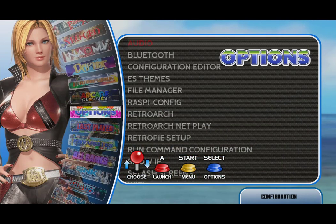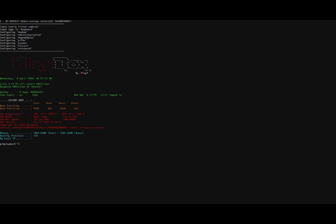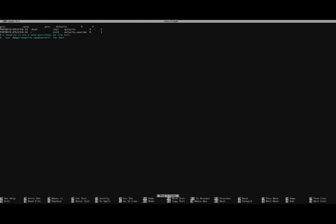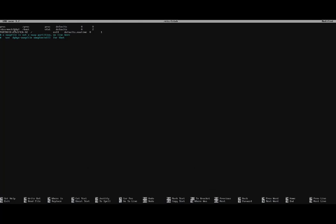Alright, we booted fine and I set up the controller. I'm going to exit to the command line. I want to note that there's no info on the boot partition — that's because we never set up the fstab, and this is the important thing to fix. So we type: sudo nano /etc/fstab. I'm going to put the command in the description. We edit the first line for the boot — delete the first part up to '01' and type: /dev/mmcblk0p1. Then press Ctrl+X, Yes, and save the file.